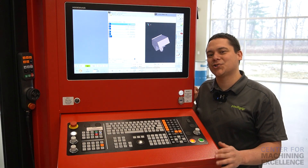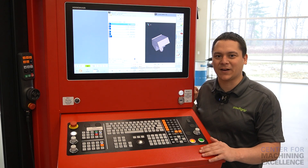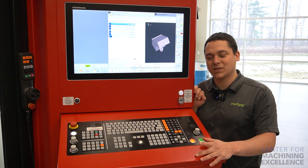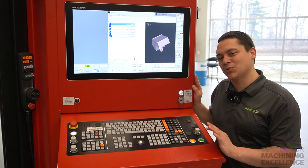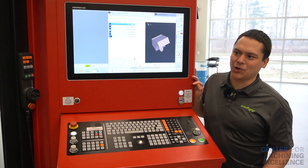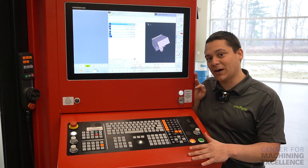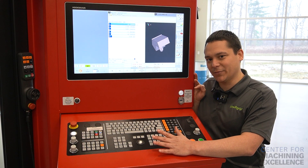When you have a machine and you're trying to hit super finishes and work with difficult materials like graphite and ceramics, what kind of control system do you use? Well, the Kern Micro HD uses the Heidenhain TNC 640 control. So instead of a generic G-code style programming format, they actually use Klartext — so you can use your ISO programming style, or if you want to simplify things when you're doing complicated five-axis parts, you can use Klartext programming.